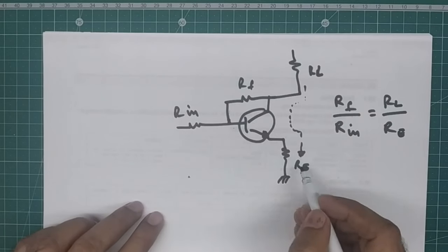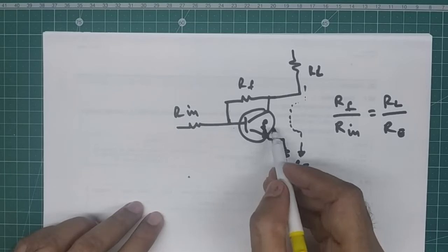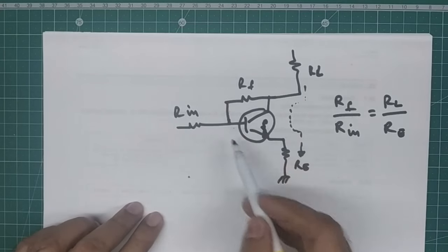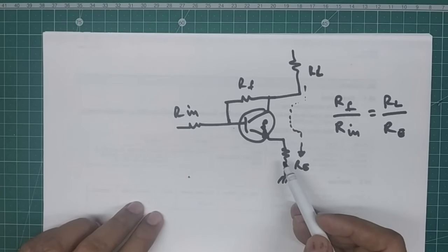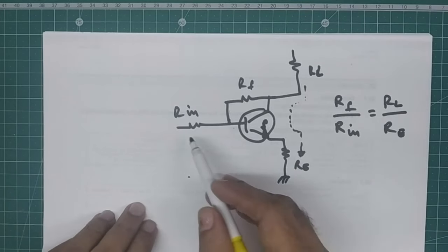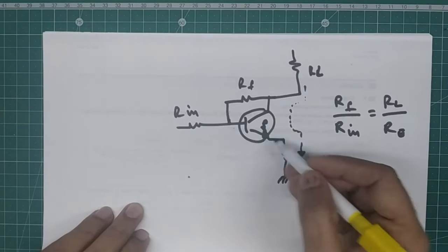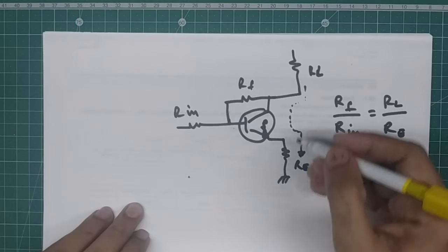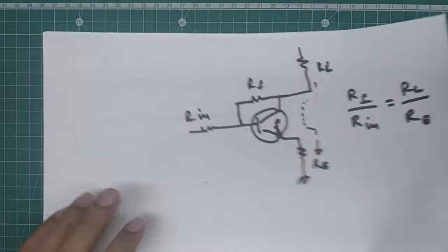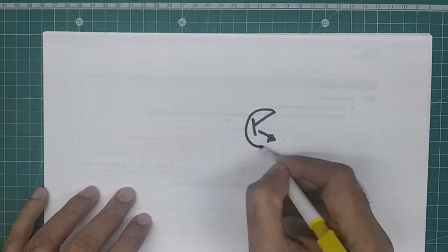RE includes a resistance inside the transistor — a small internal resistance. All the resistances we discuss are actually RF impedances. We also need to connect to a power supply to allow current to flow and switch the transistor on. The amount of current is important because more current means a smaller internal resistance. Given all this, let's start building a very simple amplifier.